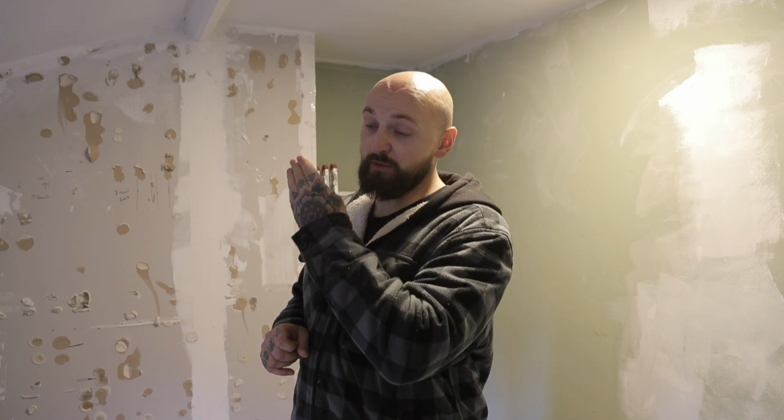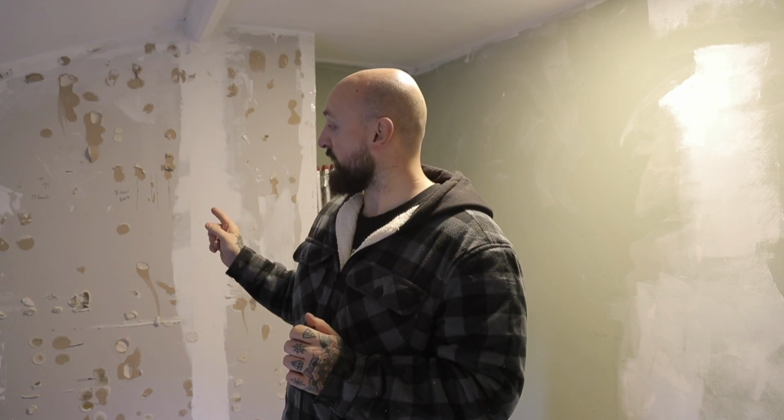I'm going to stick that on with the expanding foam, same stuff as we used for the plasterboards. So that'll get stuck onto there, left for a little bit to dry. Then that's going to get painted. Then I'll leave the paint to dry. Once the paint's dry, I'm then gonna stick on the vertical slats, and I'll obviously space them out, the correct spacing, etc. I'm gonna stick them on with silicone. They're very light, it's only 9mm ply, so they don't even need nailed on or anything. I'm just gonna silicone them on and they'll be nice and strong.